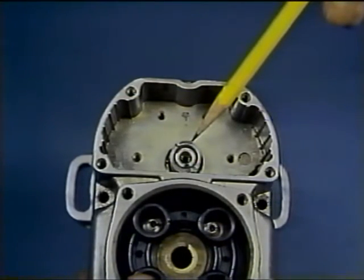In this training program, we are concerned only with the timing procedure. All other assembly details, such as lubrication and bearing preloads, must be performed according to the manufacturer's overhaul manual. Now with the two gears properly meshed, the cam is slipped onto the shaft with the arrow pointing in the proper direction of rotation, then secured with the correct washer and screw.